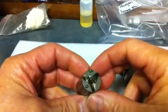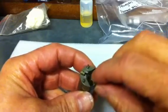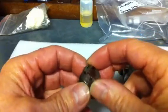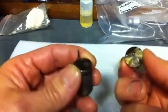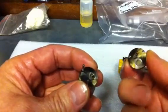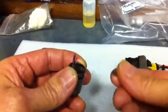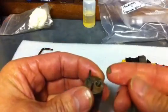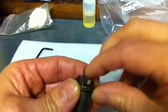At the top of the fuel plate, there's a ball bearing that fits in there — that's part of the fuel metering plate. This one's beat up a little bit; it must have had some dirt in it while it was being fired at some point in its lifetime. Between the two of them, there are two fuel plates here. There's a little hole in this one that controls the metering into the plunger area, and there's a little square or rectangular piece that sits inside of that hole — that's what provides metering, along with the ball bearing, to the injector.